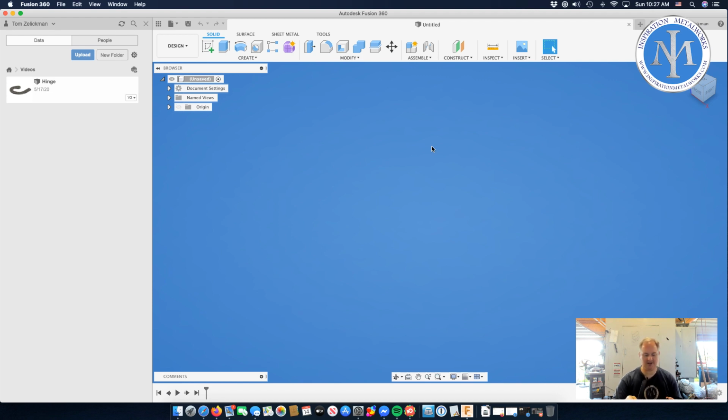to the start of this angle, but we've got an angle, you notice, that's not straight, it's not perpendicular, right? So we know it's 2 inches, and if I line this up with that, looks like it's 4 inches, or 4 1/8, roughly. 4 1/4. We'll say 4 1/4. Now the middle of the bend's at 4 1/8. Okay. So we've got a pretty good idea of from here to here, from here to this line, like where the straight lines would intersect. So we can start mapping this out a little bit.